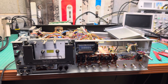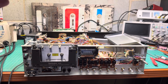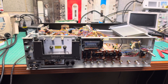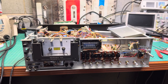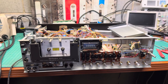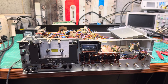From everything I've heard, for most decks when you have large capacitor values, Nichikon audio capacitors sound the best. I wish I could install film capacitors everywhere — like Wima — but first it would be crazy expensive, and second, the values used are usually large, making them physically impossible to fit inside this deck.